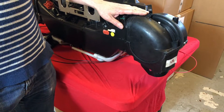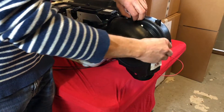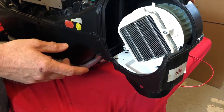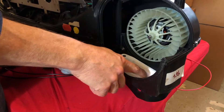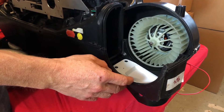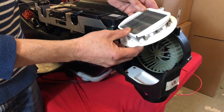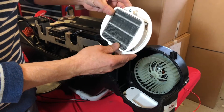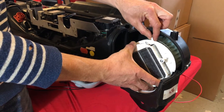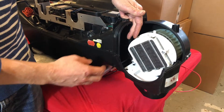We're looking at doing this electrically, so this is what we've come up with in terms of an electric heating solution. The first thing we've done is blocked off the bottom of the inlet so there's no hot air coming up from here because we don't need it anymore — the flap has been deleted as well. This is a PTC electric heating element, and we've designed it so it fits in the place of the trumpet that you saw on the other side. This is a three-stage heater, and it will be controlled by some electronics.